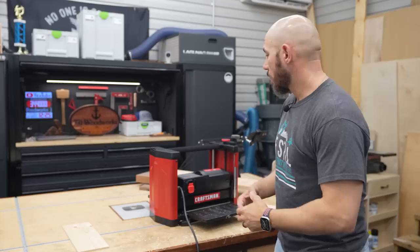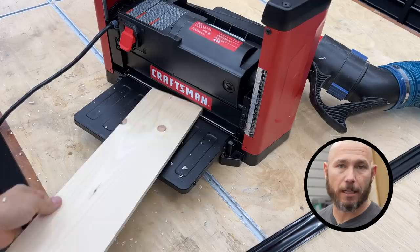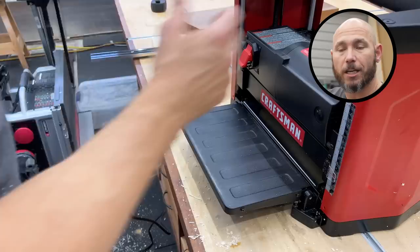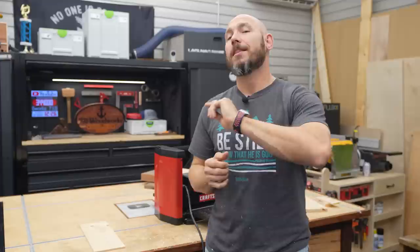Once I got it dialed in on the cheap spruce, I started running it through multiple times and got it down pretty thin — probably a quarter inch — so I planed off at least a half inch taking little bites at a time. You may also see me angle the board slightly; if the board is narrow enough I like to send it through at an angle, as that helps with both tear-out and snipe. Then I started running a piece of maple through and it did extremely well. The finish on the maple is almost butter smooth — probably 120 grit or finer if you were sanding. It does have a tiny bit of tear-out, which is notorious for maple even on the DW735. Power tip: just spray a little bit of water to dampen the grain, then run it through and it shouldn't tear out.